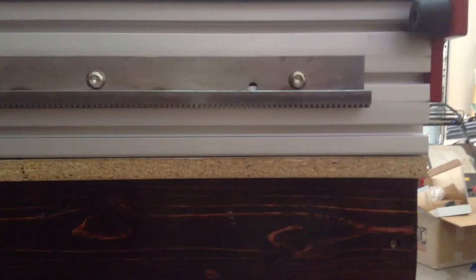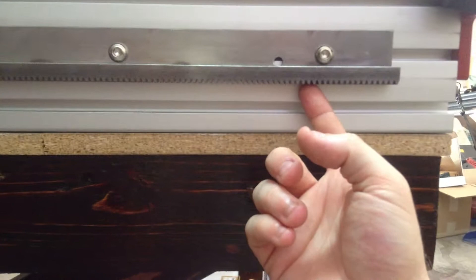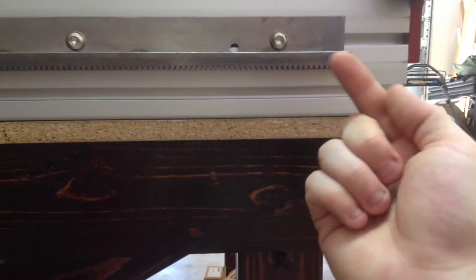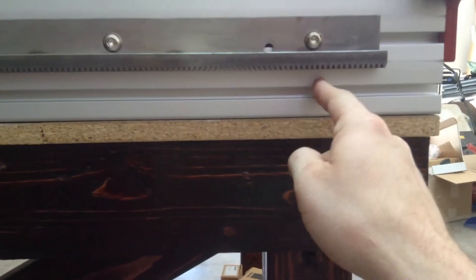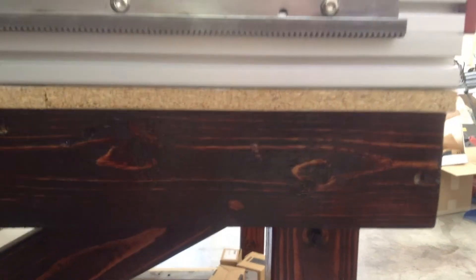The racks. This is a 52-inch Pro gear rack from CNC Router Parts. It comes with a flange, and the gear rack is nicely spaced off of the extrusion so that you can get full engagement of your linear motion gear when it's on there, instead of the gear being off the extrusion a little bit where you only get 75% engagement. This has 100% engagement, which is really nice.